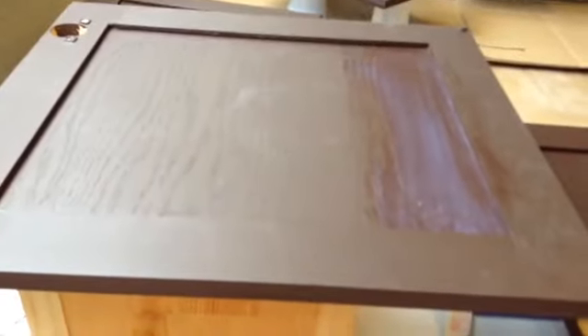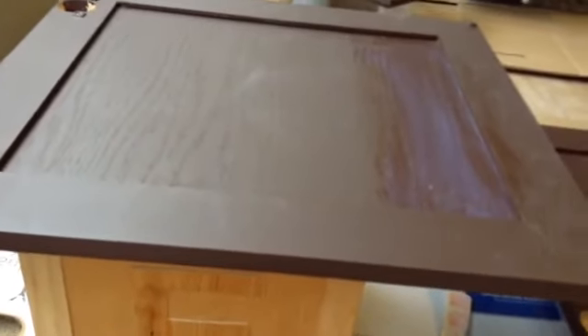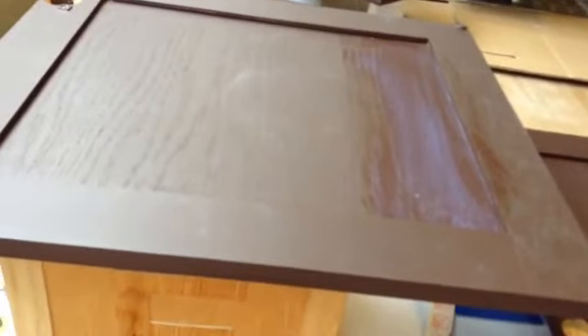You have to be extra careful on all of the edges and make sure there's no thick coat on it. Spread it out really good before letting it dry because it will dry and you will have a white line. It's a thin coat and it dries very fast — you can tell where you haven't added it well, for example where you can still see dry wood. Add the top coat to the back of the cabinet doors and let it dry for at least two hours before flipping. Once you paint the front of the doors, let it rest for 12 hours. Don't touch them, just leave it as is. Work fast because this dries very quickly.